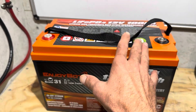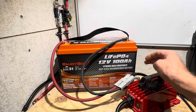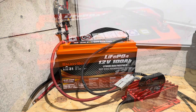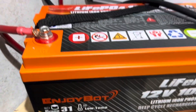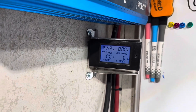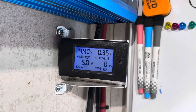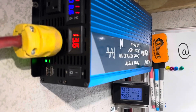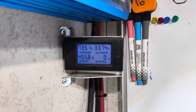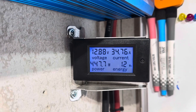I'm going to start the capacity test — charge it all the way up, then pull it down and see if it delivers rated capacity. I used a commercial charger to top it off, then got the Enjoybot on the capacity test rig. The energy meter is pre-zeroed; the battery is at 14.43 volts, so it's fully charged. I turned on the inverter — about 5 watts idle draw — then connected the load: charging a portable power station at roughly 380 to 400 watts AC. We settled in around 34.75 amps, 447.7 watts out of the battery.